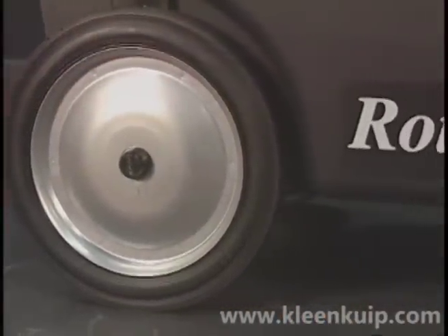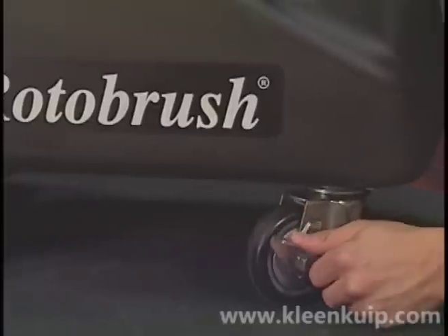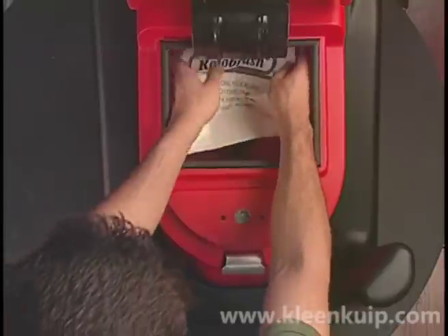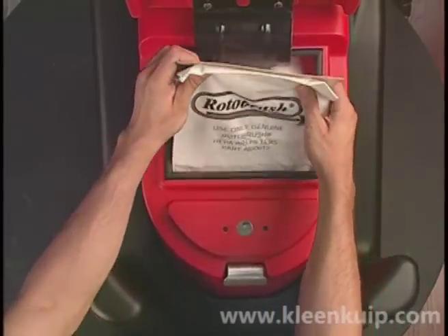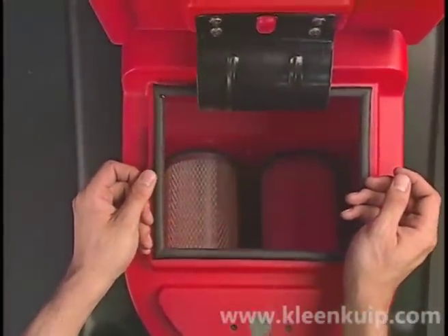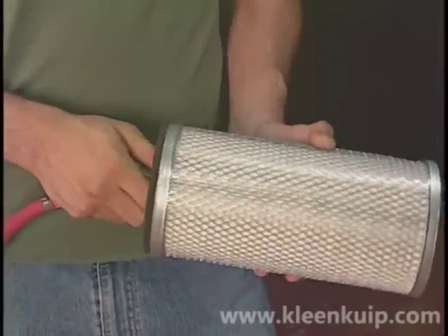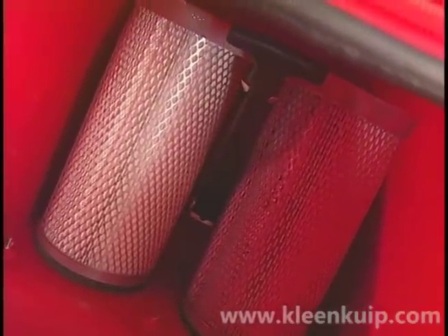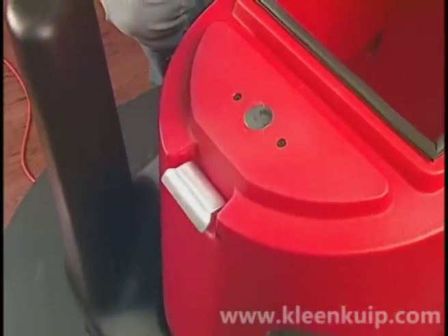The carrier has large rear wheels for ease in moving up and down stairs, and the front wheels are locking casters to fix the machine's position during cleaning and transport. Beneath the hinged top cover of the power pod are the machine's filters. The pre-filter bag is specifically designed to capture the larger dirt and debris from the air ducts and extend the life of the HEPA filters. Pre-filter bags should be changed when about half full. The Rotobrush Air Plus has two installed HEPA filters. When cleaning these filters, vacuum the outside with a shop vac and then blow them from the inside out with compressed air. Never clean any of the filters with water. The lid of the Air Plus is magnetically secured and is then further secured with negative pressure once the vacuums are enabled.